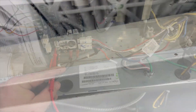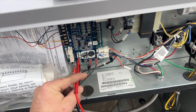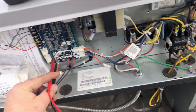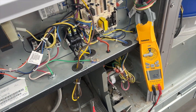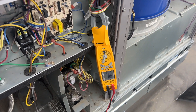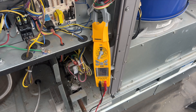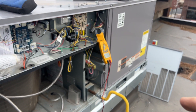Checking our blower motor — it's on the A setting, which maxes out at about seven volts DC, and we're right there, so it's on full blast. Amp draw seems normal — keep in mind we have all the panels open. We got heat because I reset it. Amp draw is normal. Going to put the door back on and shut this off.